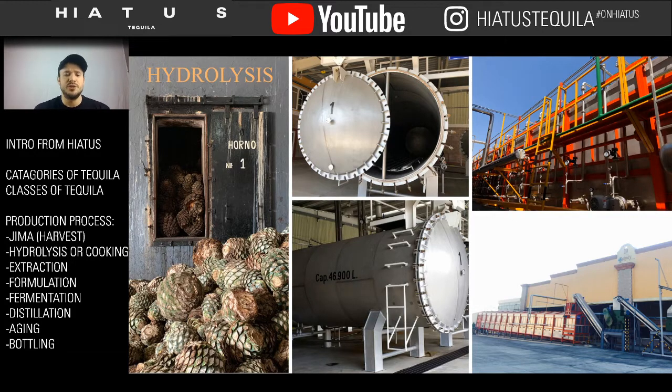The picture here on the right is a picture of a diffuser. They're huge industrialized machines that take up the space of roughly a football field in length. They are very, very long. There are multiple different types in a diffuser. I'm only going to talk about the type that the Mexican government really harps on, called an extraction and vertical autoclave diffuser. The first step of the diffuser, in the bottom picture here, you see these ramps that look like they're going into the plant. These ramps are wood chippers. You drop the agave in, it goes up the escalator on a wood chipper, and it gets washed with water. The water washes out all the sugar, then it goes up the next and does the same, and the next, and then it falls into this big machine, which is the actual autoclave.